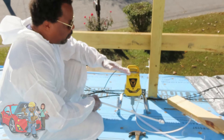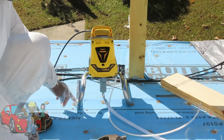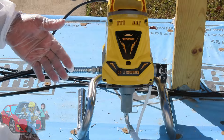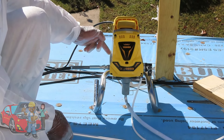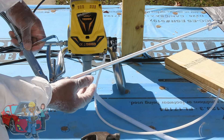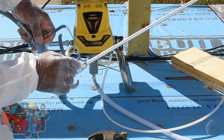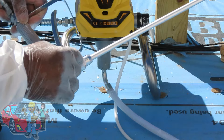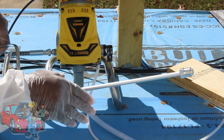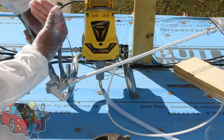We've got the machine. We're on a roof here on a little pitch, so I put a horseshoe nail right there just to keep the unit in place. When the unit is running it doesn't vibrate much. First thing you want to do — you should have already had this done — put your hose on, connect it here, make sure the fittings are tight. It comes with two wrenches to tighten it up. You may or may not need the wand; I like using it. When you put the wand on, make sure there's a white plastic gasket in there — do not throw that away. That seals the paint. Do not put the tip on yet because now we're going to prime the system and the air line.